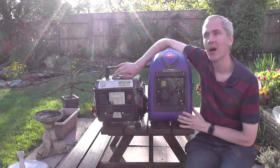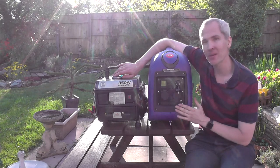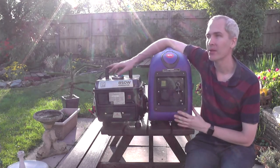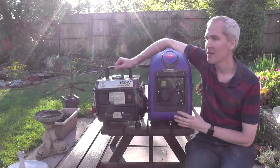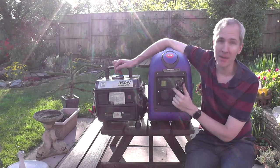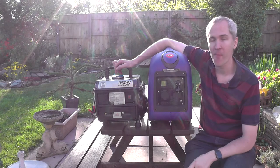This one, I will simply plug into the 220 volt 16 amp input on the boat, which will go through the galvanic isolator and use the boat's Victron Blue 30 amp charger to charge the batteries. Whereas if I use the charging cable that came with it, it would only charge at 8.5 amps. That's it.